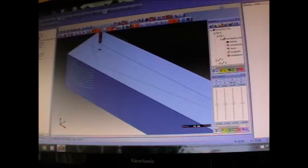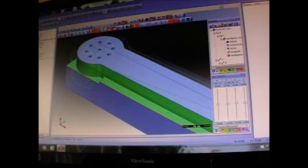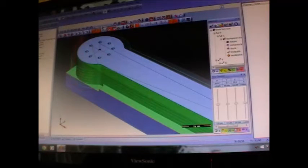First off we're going to drill holes — this is drilling 8 x 2mm holes in the corners of the octagon. Now we'll simulate the bigger cutter, the 8mm cutter, running around the outside. That's cutting down about 15mm deep.